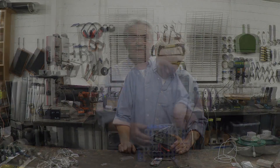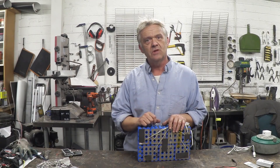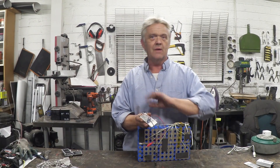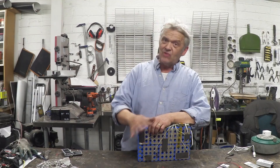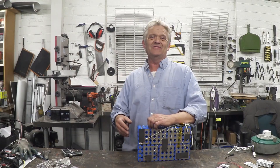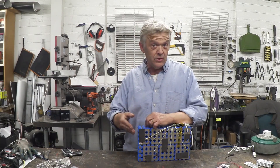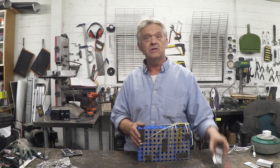In video 1272 and 1273, I did tell you how to check the batteries and make sure that they're roughly in the same capacity. Because what you'll notice when you look at a big battery bank — this is a kilowatt-hour battery bank — each individual cell is not controlled; they're put into groups, and there's control over the group. So putting two together with one little controller, no worries. What they do is check that the capacity is roundabout the same — it doesn't have to be identical, just roundabout the same. Sure, if they're not identical it will reduce the life a little bit, but using second-hand batteries, any life you get out of them is just plain awesome. So do the checks, watch video 1272 and 1273, make sure they're roughly in the same capacity — sticking two together like that is no hassle at all.